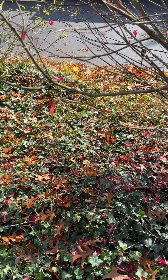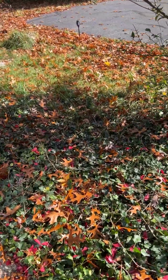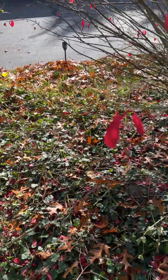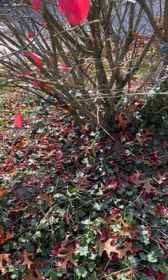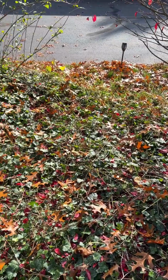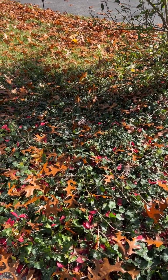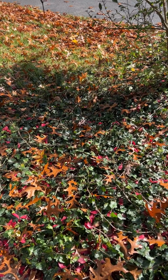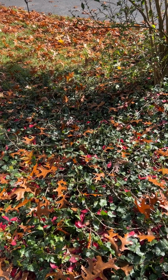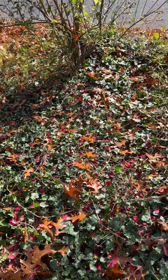We also have a drip irrigation system underneath this ground cover and flower bed, and you're not going to be able to hear the water coming out of that system since it's underground, but just run it anyways, and the water will be pushed out of the tubes, and you'll hear a high-pitched air sound when it's towards the end of emptying those lines.